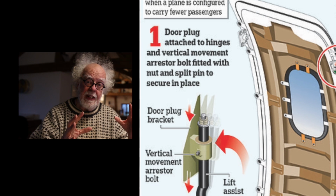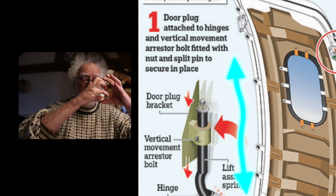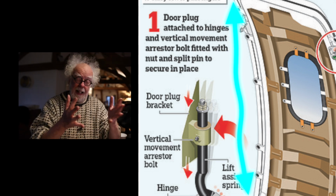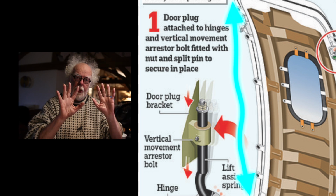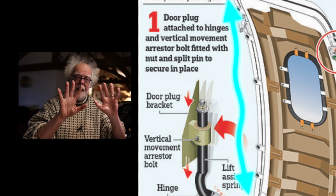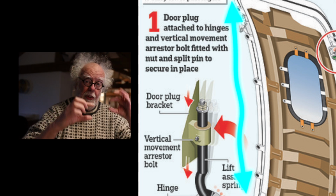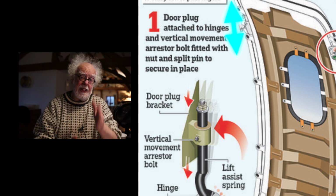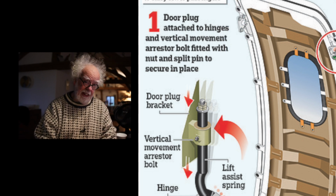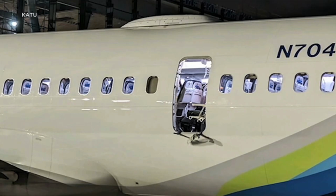The next thing that keeps it in are these 6 pads, both on the plug and on the fuselage, and they have to fit together. And aircraft are pressurized, and this plug is inside the fuselage, so the pressure of the cabin is actually going to help it seal. And that pressure keeps these 6 pads on the 6 pad seats very firmly. But this is the big point. Occasionally, it would be great to take the plug out to have access to the cabin. Let's go over how you take one of these plugs out.